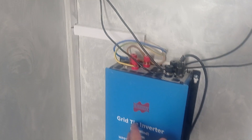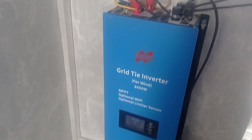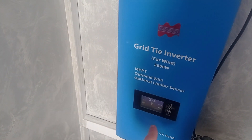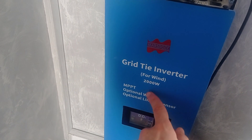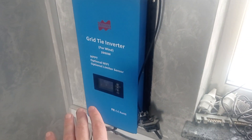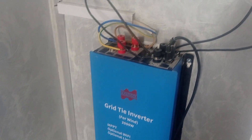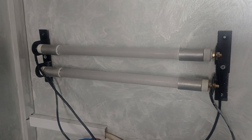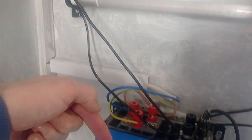That's why this setup is more effective. The only thing to consider is not to burn it out. Don't go too low with resistance, because in my working range of 22 to 60 volts — and this is a 2000-watt inverter that can handle 45 to 90 volts — if the wind goes way over 100 volts and you're using something like a 2-ohm resistor, you'll end up with 50 amps shooting into the transistors that operate the dump load switching, and you will absolutely burn them out.